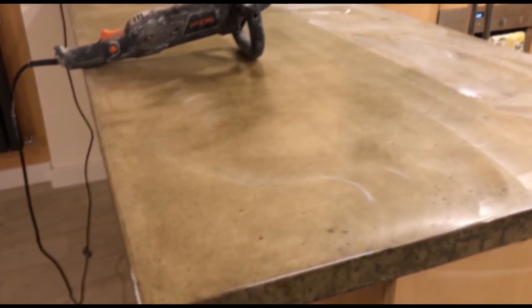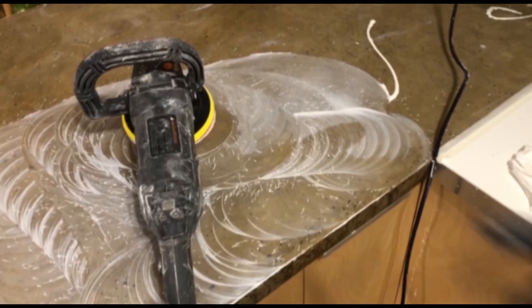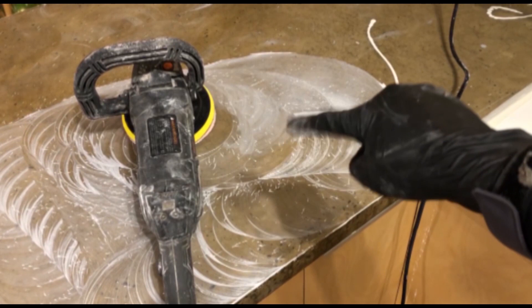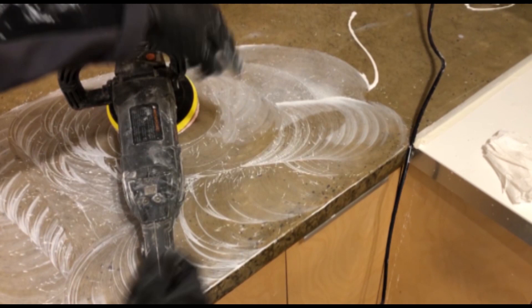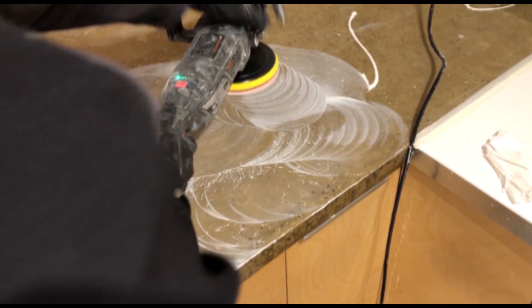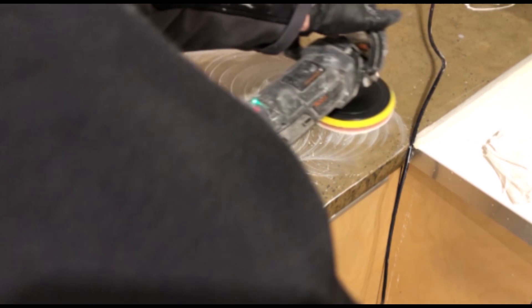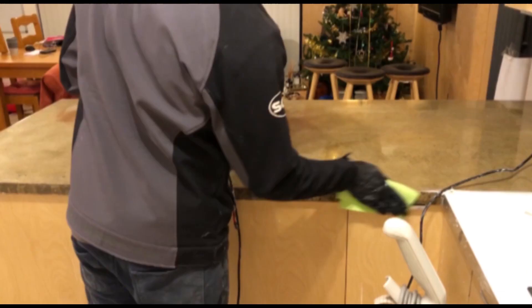You can see there's some polish still left on the surface but it's starting to get a lot more shiny. I'm going to do it in quarters — this side first, then the other sides. Then we'll wipe it all off and move on to the next polish. You can see in the surface while polishing there is a white patch sticking to the surface — when it's been polished and becomes glossy, that white patch goes away. That's the 1200 grit turning into a high gloss finish. Use fairly hard pressure at low speed around 600 RPM, then in a second pass reduce pressure and increase speed to around 1500 RPM, then wipe the surface clean removing all residual polish.